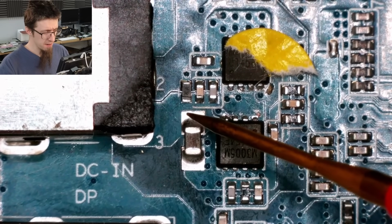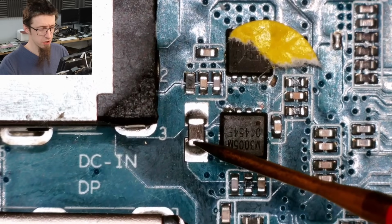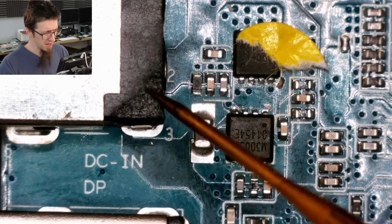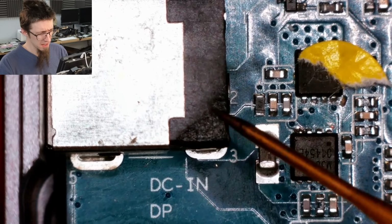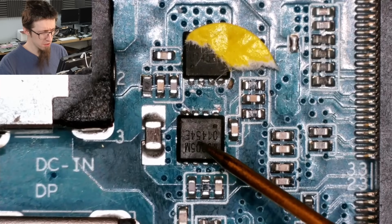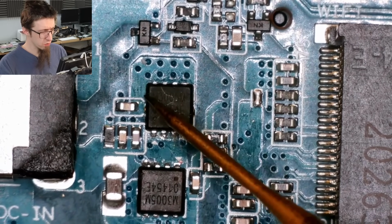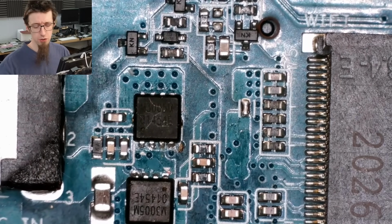And pin 3 immediately comes down into this inductor here. That inductor is just going to smooth out any sort of sparks and sudden inrush and EMI and that kind of thing. There's been some heat there. That guy's a little bit toasty. Just a thought. Anyway, so we come down through here, then we go through this MOSFET, and then through this MOSFET. And then we go into a bunch of vias and down into what will become the main power rail. So is that shorted, first of all?